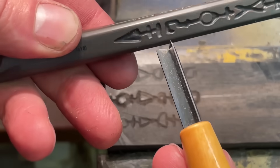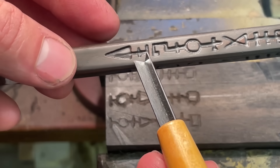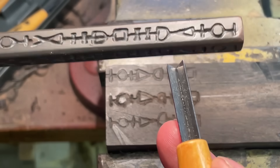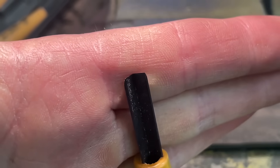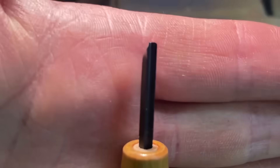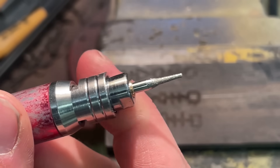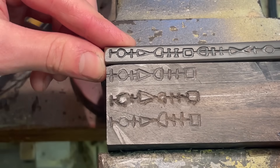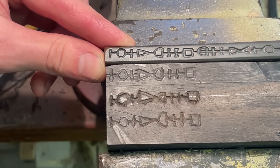The runes on the handle are the same on all four sides apart from two tiny lines, so I wonder if this was a mistake or intentional — either way I'm going to copy them as is. I've done a test piece using different tools: the first gives a V channel but leaves the end quite pointy; the second is the small gouge which I think looks neatest; and the middle one is just with the air Dremel. The issue with handheld rotary cutters is they really tear up the surface and also tend to wander around, so I think the gouge looks best and we'll try that first.